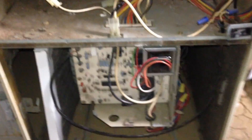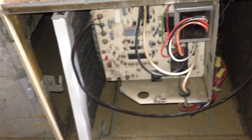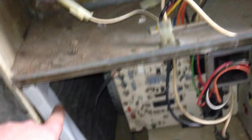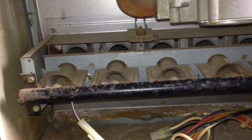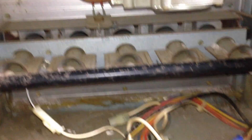Now I'm down here in my basement. My furnace isn't quite too old but you can tell it's pretty dirty. If your furnace is not working or not starting up as it should, change your air filter to start off — you can see mine is dirty as all hell. Also if you have ventilation vents in your house, you want to make sure there's no clothes on them or hampers, that you've moved anything blocking them.